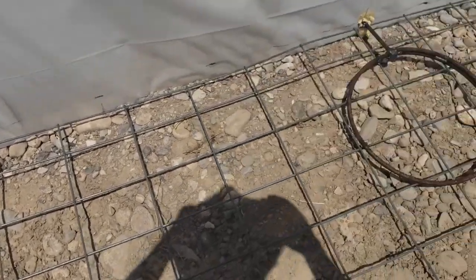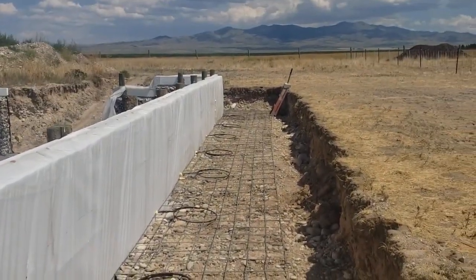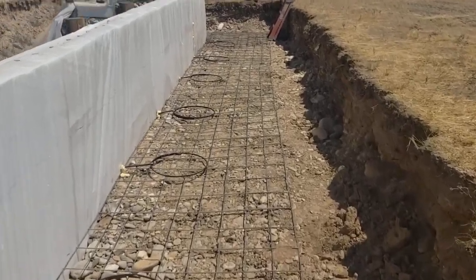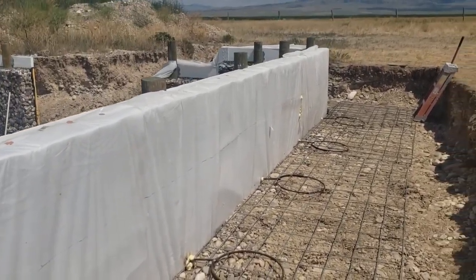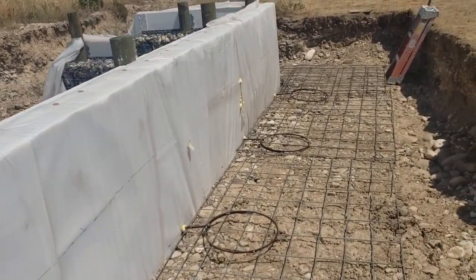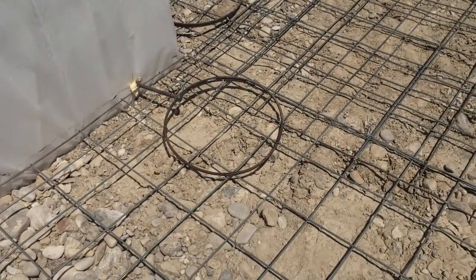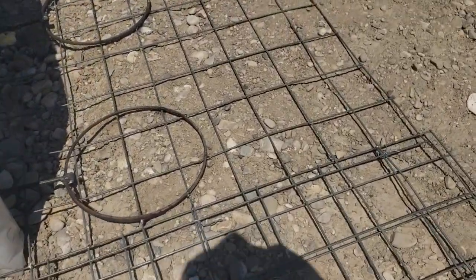The hoops are about 18 inches in diameter. There's about 20 of them I've got in here on this south side. I wanted to give you a good look at the progress here and why we're putting this anchor grid in — it's kind of important because we've got a lot of loose cobblestone fill, and there's just a tremendous amount of pressure that's going to be on this south wall. Plus the slope of the roof is all coming this way, so all the water is coming this way with this one-slope roof.